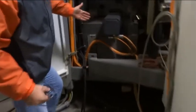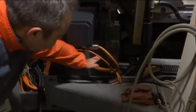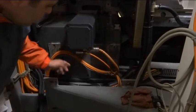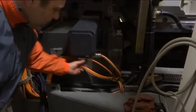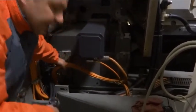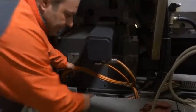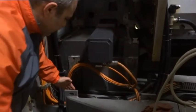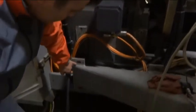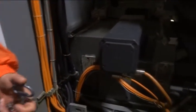We go back on here. You see these holes here, these holes will be attached to the base of the machine. And what I would do is, you guys take the motor power cable and feedback cable off here, unscrew this, so that you have the wires clean and easy away here. Somebody needs to watch when you put this arm back to it. You see the old screw where it was connected, you can leave that open, and then you level the tool changer up to the machine.